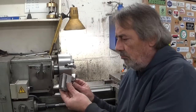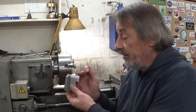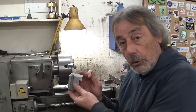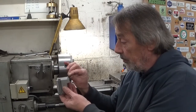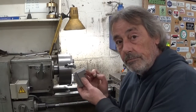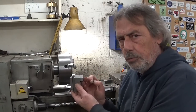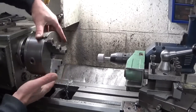So I think the best thing to do with these jaws is to re-grind them — but not square. Rather, 1/10 of a millimeter on one side out of square. That could be a challenge: to re-grind the jaws in my 3-jaw chuck.